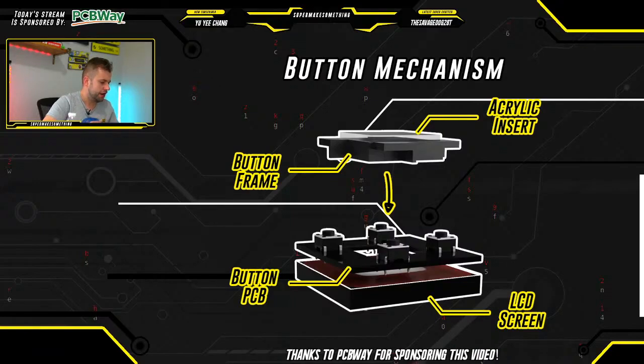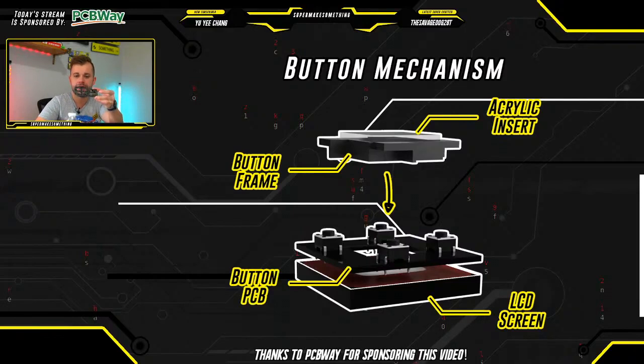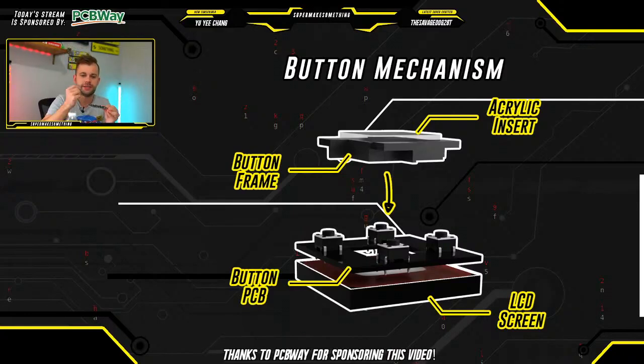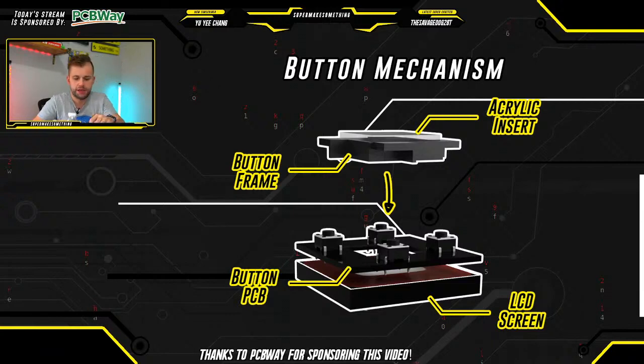So I instead opted to make the entire Stream Deck using a set of push buttons. The way this works is that underneath this PCB here, we have an LCD screen, and around each of these holes on this keyboard PCB, these little square windows, is where you would see the icon pop through of the graphic that's displayed underneath on the screen. We have a bunch of push buttons, and the push buttons around the button hole are wired in parallel,